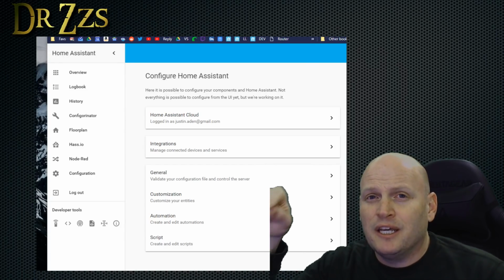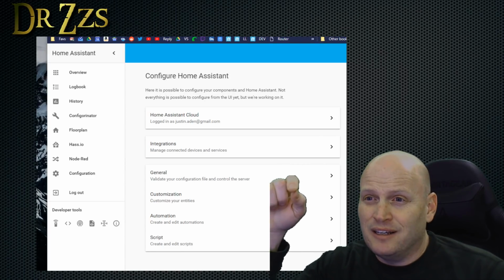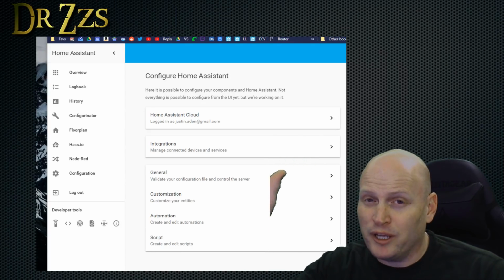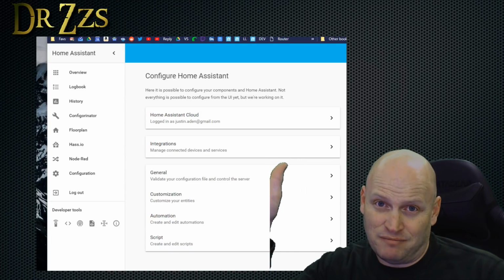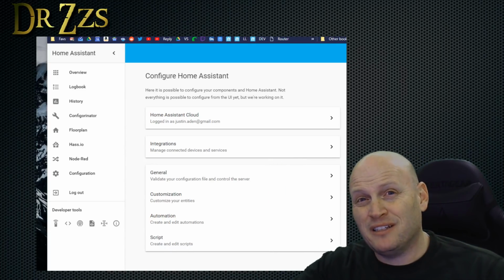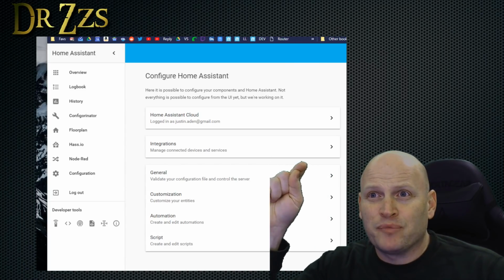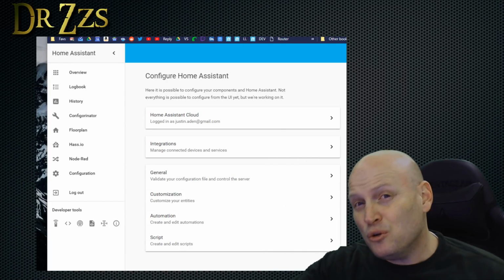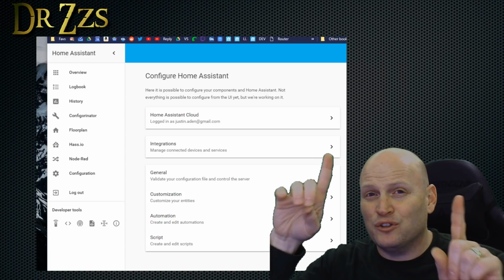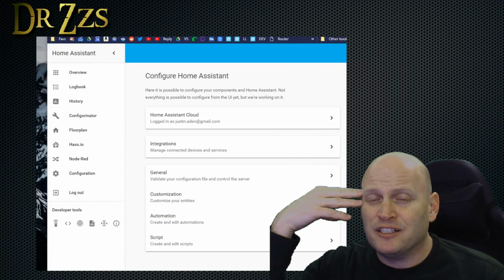and in there it will tell you what version of the firmware it is. If it has version 1.6 or version 1.8, as far as I know, to this point, you cannot use the OTA to update it or to flash it. I hope somebody tells me I'm wrong, but that's been my experience. Version 1.5 you could do it on, and version 2 you can do it on. But for those two in the middle, version 1.6 and version 1.8, the OTA flashing doesn't work.